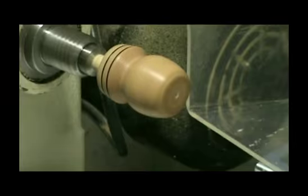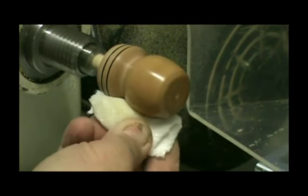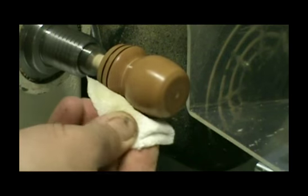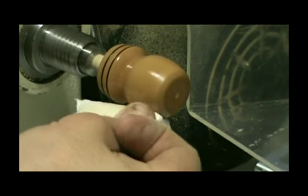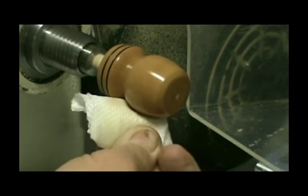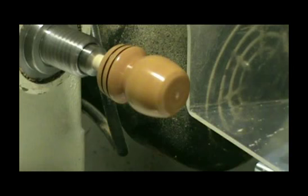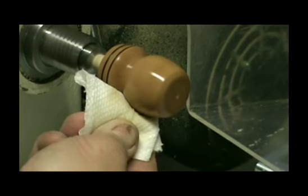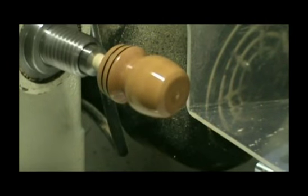French polish. I'm a cabinet maker mostly, and I really like shellac because I'm terrible with a brush. And it really is such a beautiful finish. It's solubilized in ethyl alcohol, so it's not some horrible thing to breathe. And it gives you a very durable finish if you don't get it wet.